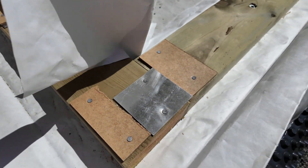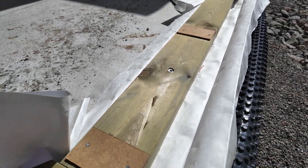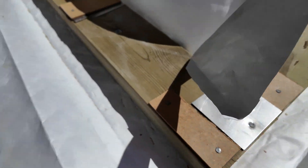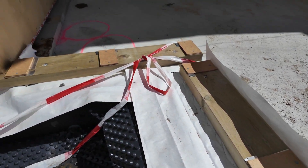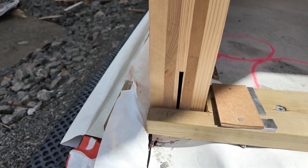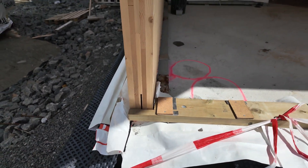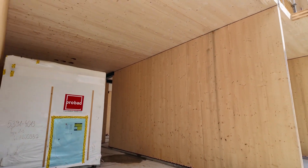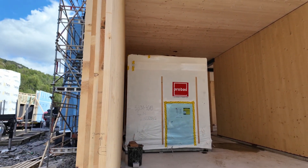Notice how they've gone around and you can see there's been a number of shims — some of them taller than others. This one's just a single metal shim and then this one's on a few more, so I think they found the high spot and then went around to set up those panels. One of the beauties of the CLT is they have those knife plates where they have the ability to put those in the middle, and then you get that really nice spruce interior.